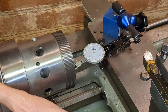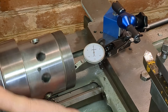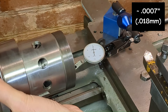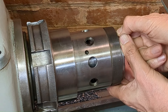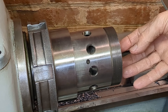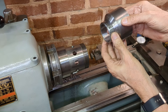Okay, here we go again. The run out now is a little bit more — that looks to me like seven tenths, a bit difficult to tell really, but certainly more than it was. There's actually a set screw with a little key, so a slight amount of eccentricity in the sleeve could be arranged to cancel each other out by rotating the sleeve and keying it. Here are the two keyways and they both look original to me.